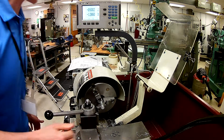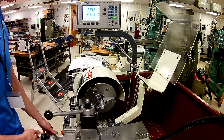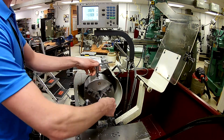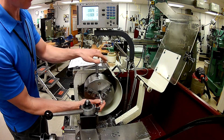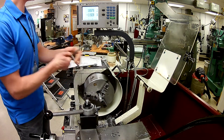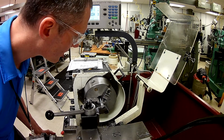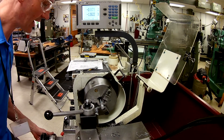There is a good bit of chatter, and that is a problem. So what I'm going to do is back everything off, open this up, and figure out what was loose. Chances are, working off this small stem has done it to me. So I'm going to move that over here so I have a little more rigidity and repeat the process — run back over here, touch that off Z zero, then go over to the half inch mark.